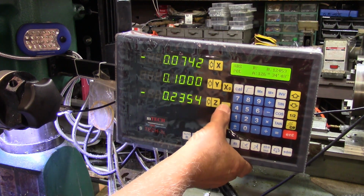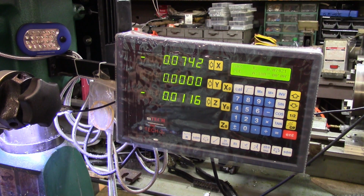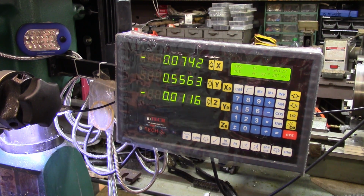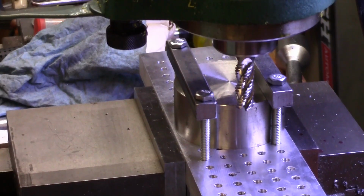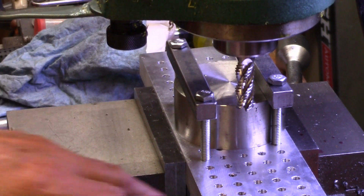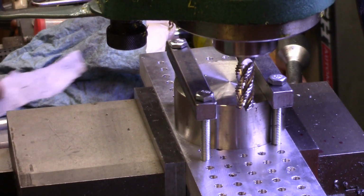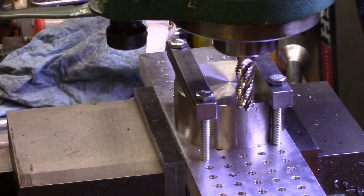And so when I get there, I'm going to zero that again, and then we'll have to position our tool bit. Come over with it to, I better measure this thing and find out exactly how far it is to the exact center. Let me get a micrometer and measure it. All right, so I've got roughly the Z0 set there. Of course, it's not going to be exactly right because I used this piece of paper. That'll knock it off about 4 thousandths. But the good thing is that we can come back and use a real depth micrometer and find out how deep it really is, because I'm going to go to about 500 thousandths or 499, something like that. Not too terribly deep. All right, so let's get started.